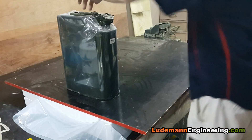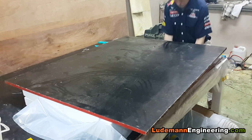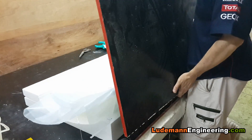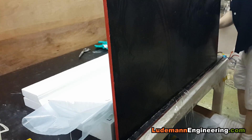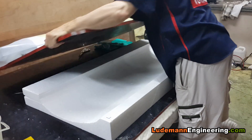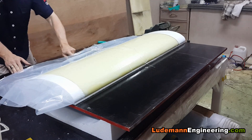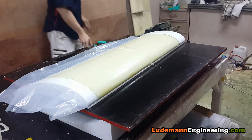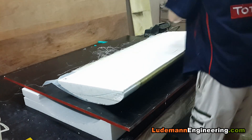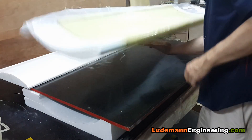The next day we're ready to take a look at it. We remove the weights and lift off the plywood board. Unfortunately, the plastic stuck to the plywood board a little bit — I should have waxed the plywood board, but I didn't think the resin would overflow that much. I had to use a springy spatula to pry all the way around it, and after that it just popped right off. Now we take off the supporting blocks and reveal the airfoil shape inside. As you can see, it's light, strong, and hard.